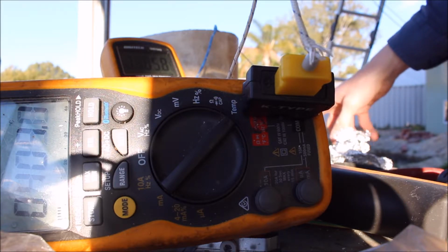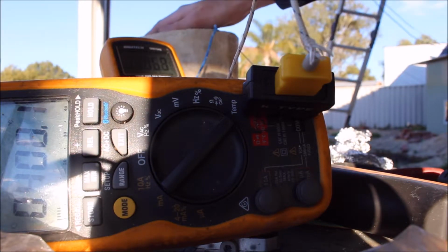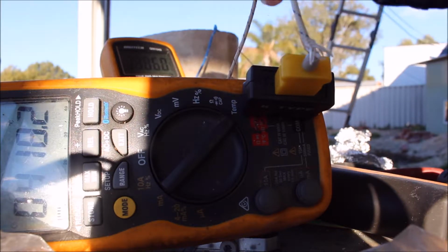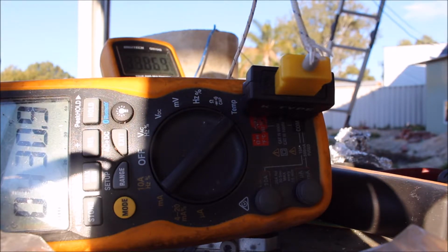Yeah, it just dropped to 13.0, dropped a couple hundred milliamps because the voltage increased, so the resistance increased, I mean. 400, 38.6 volts, and about 14 amps. This cable, it's probably 1.5 mil or so. Yeah, it's 1.5 mil cable. So there will be a little bit of voltage drop across this blue cable here. It's very mild, it's probably risen a degree or two, just the cable.